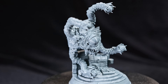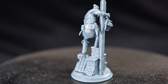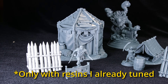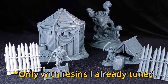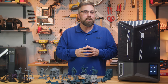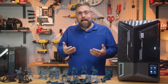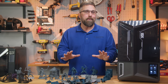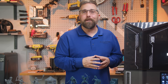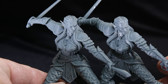To be fair, I did perform a factory reset to bring the printer back to the state before Elegoo tried to brute-force a software fix for what seems to be a hardware issue. As long as I avoid the bad spot on the build plate, I'm able to get some really nice prints out of this machine. I reached out to other reviewers who should be releasing their videos at the same time as this one — none of the creators who replied reported major issues. They had minor issues and occasional print failures, but nothing showstopping. What many of us agree on though is that marketing is increasingly trumping engineering in the consumer space. Slapping a high-resolution screen on a printer and calling it 16K doesn't guarantee better results.